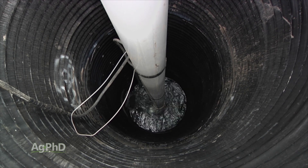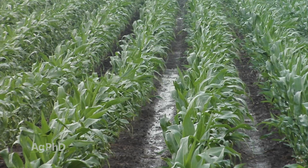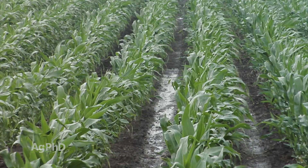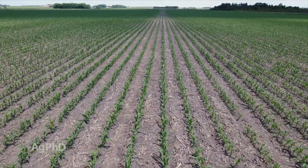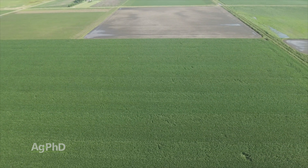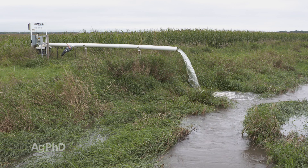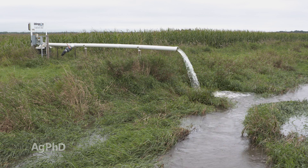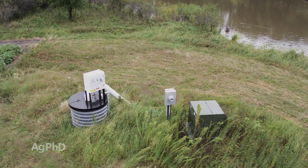It's a bigger pump, and here's the challenge for farmers: wrapping their minds around how much water is really going to move. When you think about an inch of rainfall on a field, you don't think that's very much water — it's only one inch — but it's one inch over everything. That's 27,000 gallons per one acre, which is about the size of a football field. So if your field was the size of a football field, you now have 27,000 gallons of water that either your crop is going to use, or you're going to have to pump out. With these lift stations, farmers will basically figure out how much tile is running into this pump, and how big do I need to size that pump?